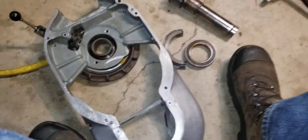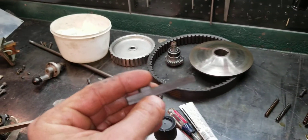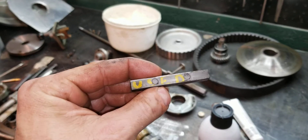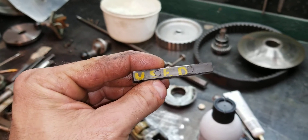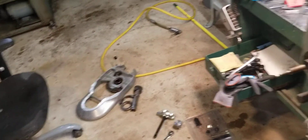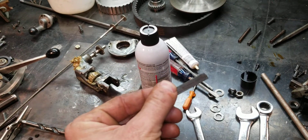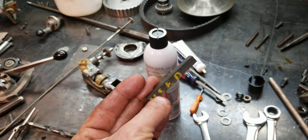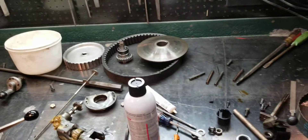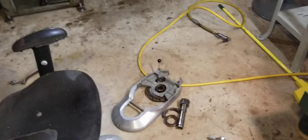That's the first part like that I've run into on this thing. The keyway and this part of the pulley were really floppy, and the bushings are bad. So evidently somebody has rebuilt this thing with used parts at one time or another. I don't have a problem with used parts if they're good used parts — if that ring was a used part and it wasn't cracked, I'd be fine with it. That piece of plastic on the other hand, I can't see using something like that used — it'd be like buying a used pencil that's two inches long. Anyway, thanks for watching, something to check for — good luck on your rebuild.